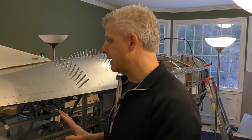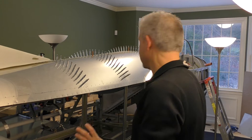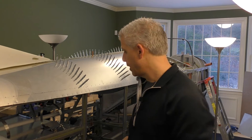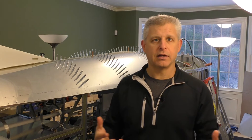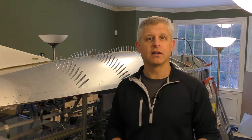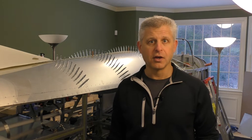It's time to start work on the next side skin, which is a really long skin that goes down the side of the fuselage. There are a bunch of cutouts used for the baggage compartment, and also to access the smoke tank. We're going to set it up, get the skin in place, and try something really unique — working with a company called Fabco to see if they can use their laser cutter to cut out these openings on this large sheet of aluminum.